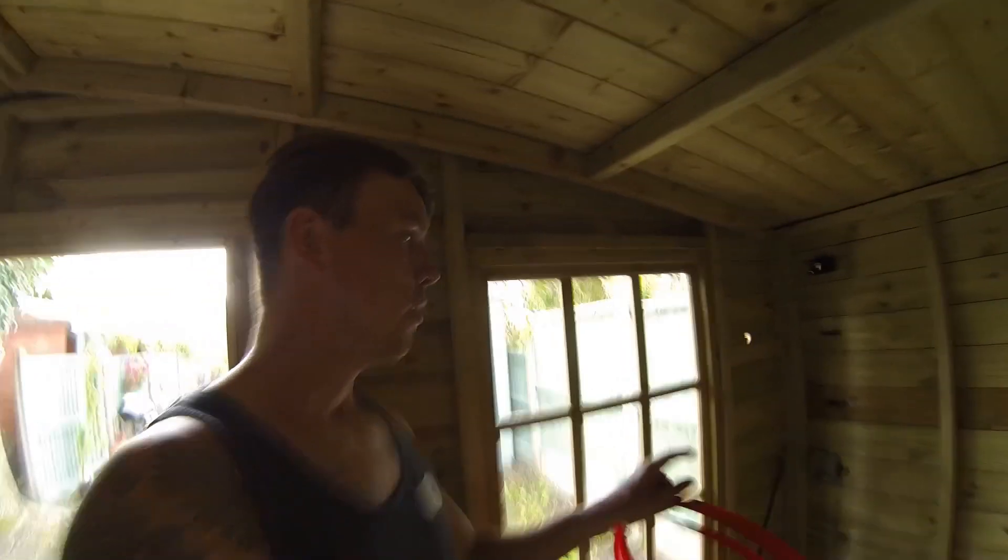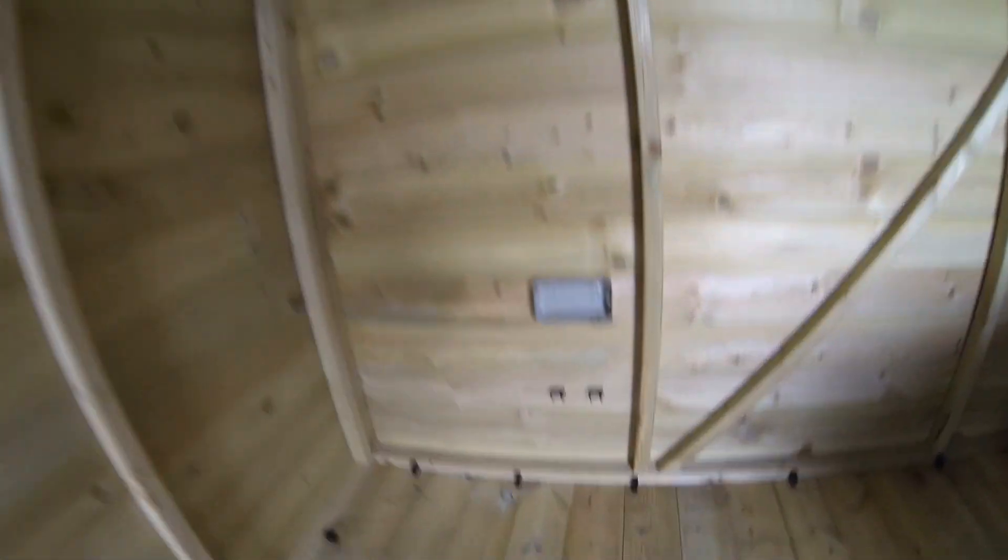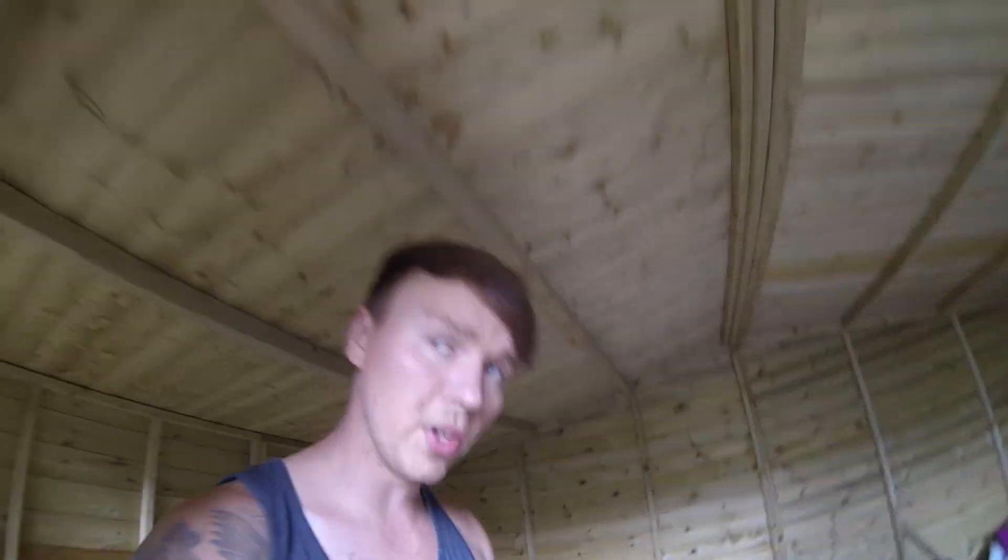Clips are in now — up top, across the bottom, done to there because there's a mover stuck. That's neat enough, happy with it. In my first video it was the first time I ever used flexi conduit and I really struggled pulling twin-and-earth through it. Pushing it didn't work, got caught, swore a lot. Then I tried a rod — clipped it all to the wall first and pulled it all back off because I physically couldn't push cable round the bends.